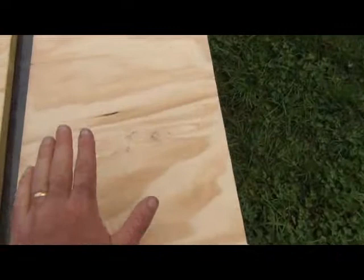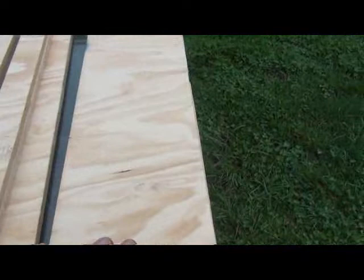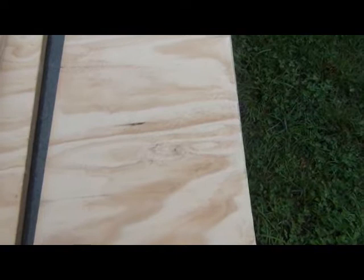I've got some bits for the wood — I've just used 25mm ply. You wouldn't have to use anything that thick for the roof, but it was just what I had left over from the ply that I bought to make the body of the hive. It'll be a bit heavier but that's alright. This is a roof frame — those are the two long bits at 75 millimeters, and the sides are 150 millimeters.